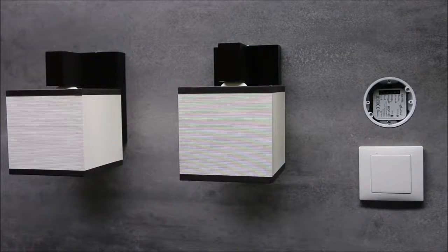Up to 32 different transmitters could be paired into one ROP-02 receiver. For example, having 2 or 3 RNK-02 transmitters, they can be paired into the receiver, thanks to which it is possible to control, for example, lighting from several different places. By this, high flexibility and functionality of the system could be achieved.